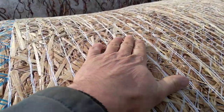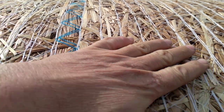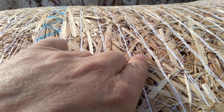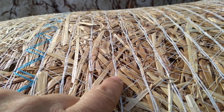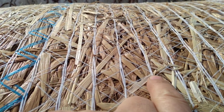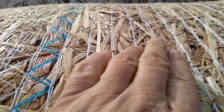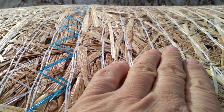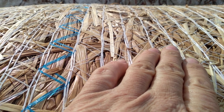We've talked about this before, but these bales are net wrapped. You can obviously see that. And that lays all these little stems down, all these little stems right here. If this was twine, where the twine would pull down like here, and then the next twine would probably be further than that, all this in here would be a bulge up, and it would have little prickly things setting up. That tends to penetrate the first layer of plastic. So you end up putting more plastic on to get it to seal, so your cost goes up.